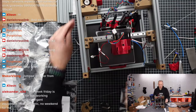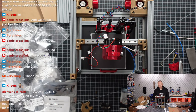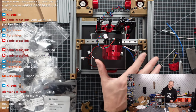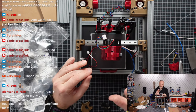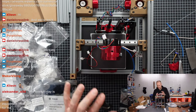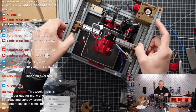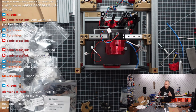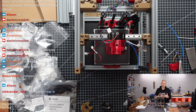One thing that I had to do, which I realized this morning when I looked at the printhead one more time, was that it wasn't completely vertical and was kind of tilted on that mount. So I took it off again, and then realized we didn't cut the belts flush to the mount last time. I had the impression that it was okay, but the belts were protruding out.